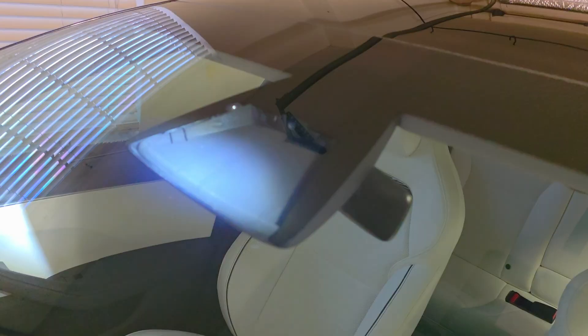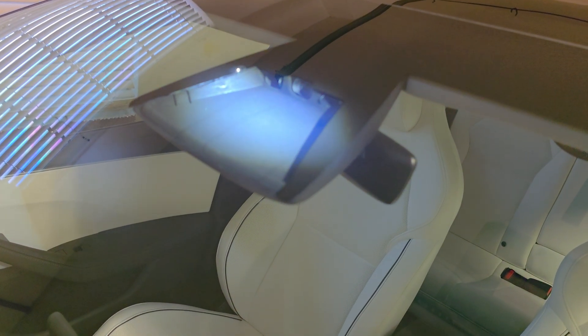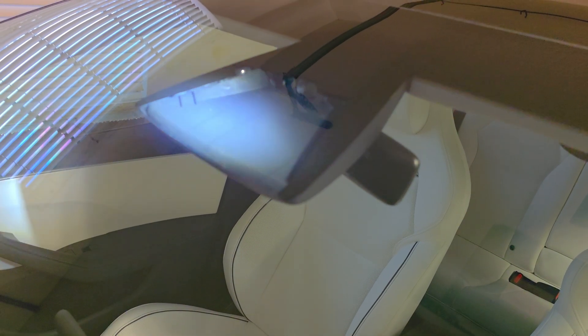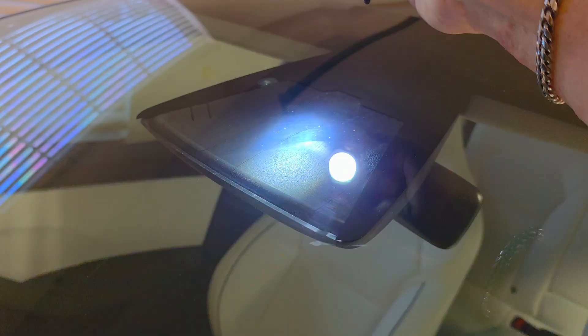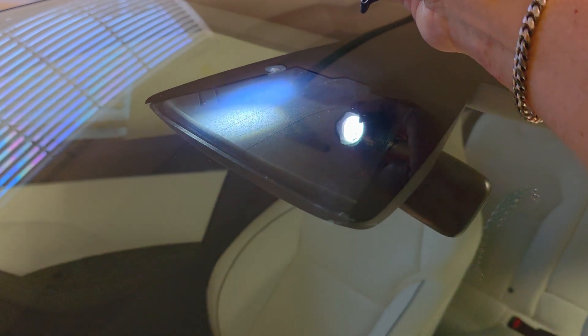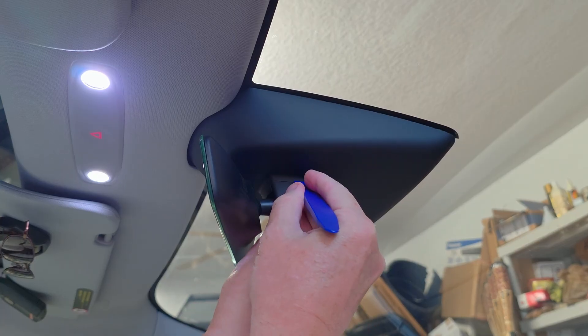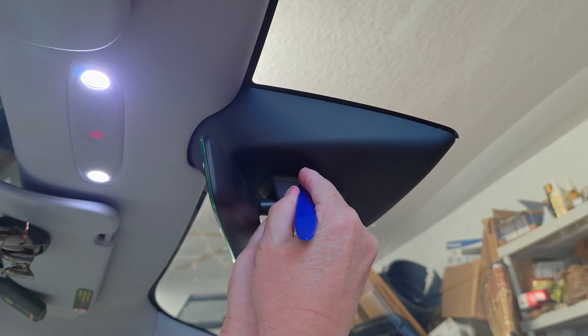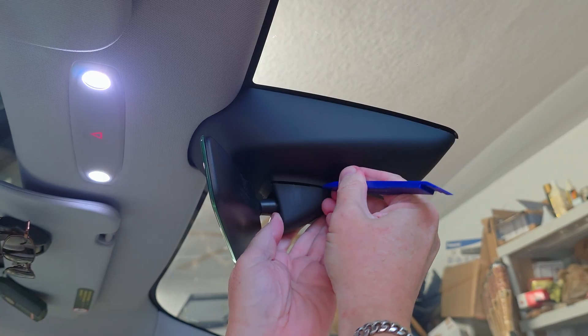There was a film then, but it's been about a year. Just to show you — it looks clean here if I shine a flashlight in the garage into the camera housing, but in order to see if you have a film or not, move a flashlight away from you and shine it back toward you on the glass, and that's when you can really see that there is a film there. That film will cause sunlight to diffract and you'll have a big, bright blob in your cameras.